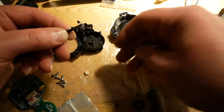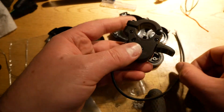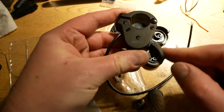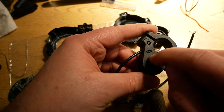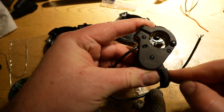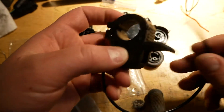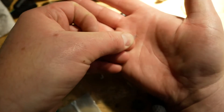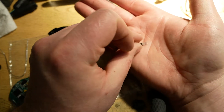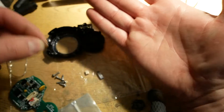You have the exact same thing happening in my replacement throttle, which is a thumb throttle. There's a pivot point around that screw right there, the hall is about right there, and there's a little curved magnet right there. When I pull this down, all I'm doing is causing that little magnet to rotate past the hall — that's it. No rocket science. Those three wires are literally exactly the same as the three legs on that hall sensor — they're just brought out into a cable rather than being legs on a part.